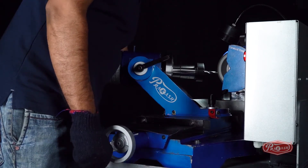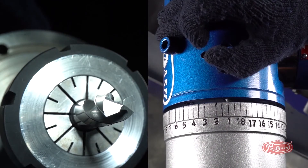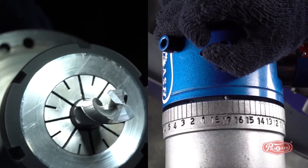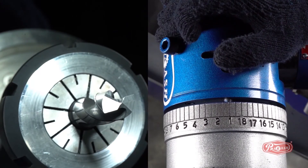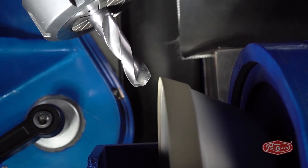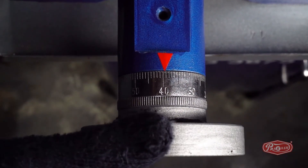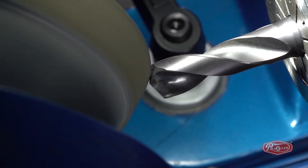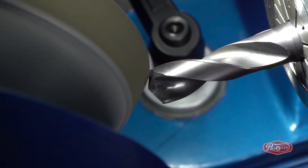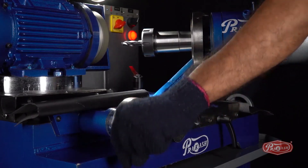Now, using the X-axis, we will move the drill bit away from the diamond wheel and set the spindle dial wheel pin from number 1 to the opposite number 1. Move the X-axis towards the diamond wheel to the number noted before, which is 40 in the video, and sharpen the second side of the cutting edge. Use the X-axis and Y-axis to move the drill bit away from the diamond wheel.